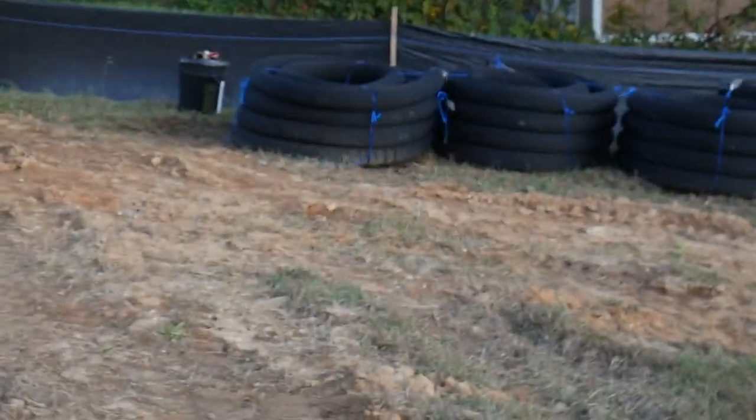Alrighty, y'all, so the sun is setting. I finished up all of the waterproofing, or the damp proofing, as I would rather call it, because that's what I was actually doing. So tomorrow I'm gonna come back with my dad. We're gonna finish up doing the French drain install, and then we're gonna backfill all the gravel. So I'll have the Bobcat out here again. So I'll just give you an idea of what the French drain looks like.